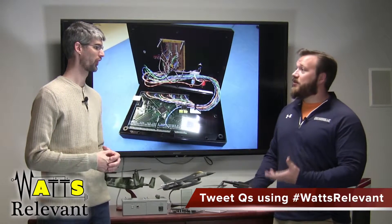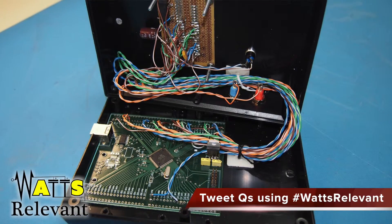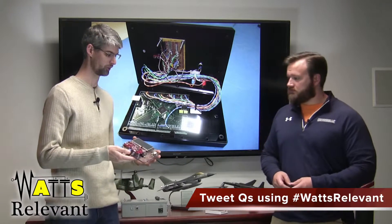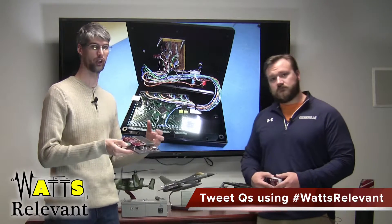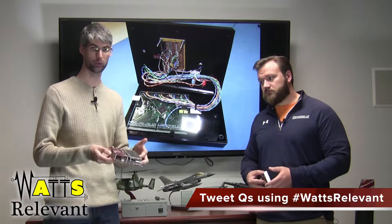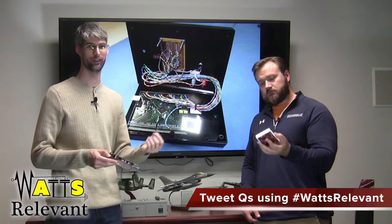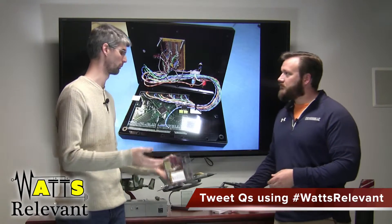That's really not our only option. We can go with prefabricated cases that we just customize. The laser cut, the 3D printing — this device here was actually a prototype of a product that we were putting together. Here it was spread out onto a piece of acrylic for the purpose of being able to access everything, so that was one version of the prototype. The next thing we did was package it into a 3D printed case to actually check: does it work in the hand? Does the software make it usable? So we're able to do different prototypes that serve different purposes.